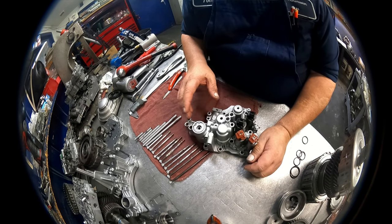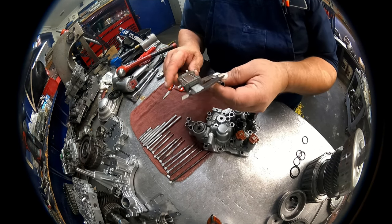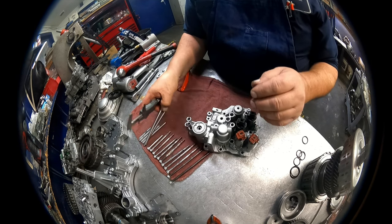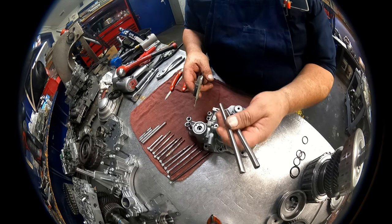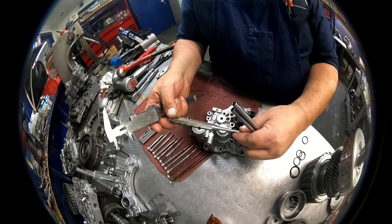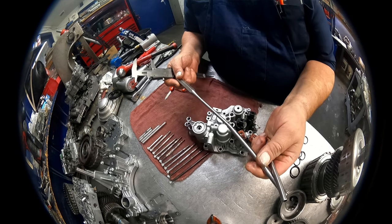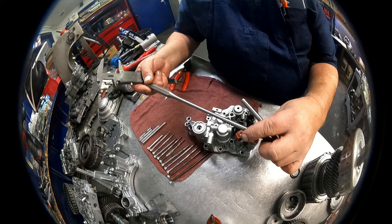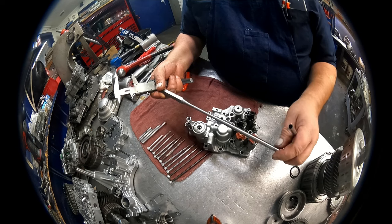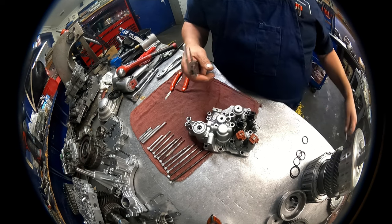Okay, the bolts, I don't remember exactly where I took them out of. The short tube, 1.569, went right there. The two long ones, these were bent. I did straighten them out. I used a punch, quarter inch punch from Mac. I used that to go up into where it was bent, which was this end. It was bent at about a 45 degree angle. And I just kept bending this around and driving this in, straightening it out. I think it got it pretty straight.